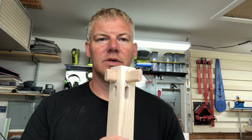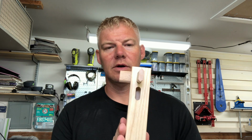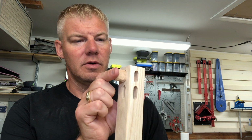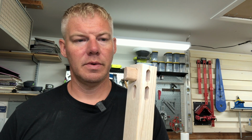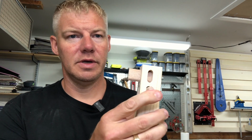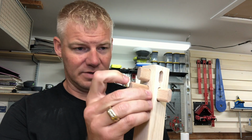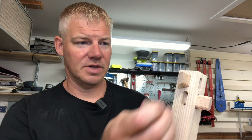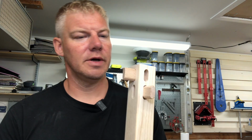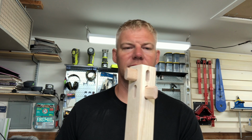seat fully. So what I'm going to do, I'm not too worried about it, very hard wood. Still plenty of glue surface. I over-engineered this when I designed it anyway. What I'm going to do is, on each leg, I want to make sure there's a fully seated domino in this direction and a fully seated domino in this direction. And then each leg will also have one where I have to trim. It looks like about 10 millimeters off of there. So I'm not worried about it at all. It's going to be super strong, plenty of glue area. I think that's the best fix for it.